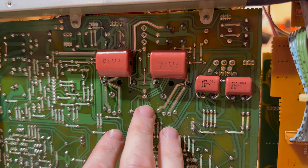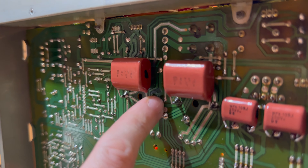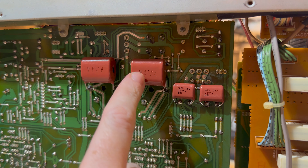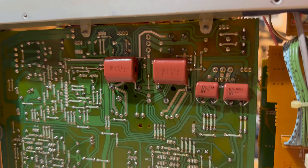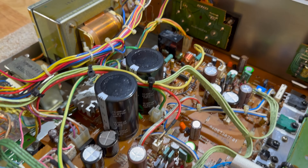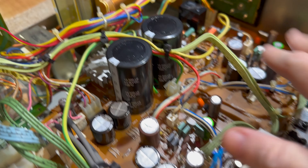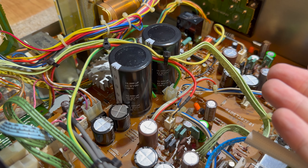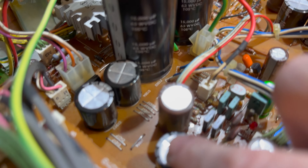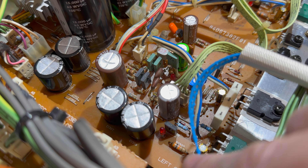There are 4.7uF film bypass caps on the power rails and 1uF on the other rail — I've checked the foil side orientation and they're correctly placed, one for the main supply rail and one for the tube section. Regarding corrosive glue: I spent a lot of time scraping it all off. That era's glue becomes either conductive or corrosive and starts eating through metal contacts. After cleaning and changing components, I also replaced all the metal jumpers since they were going black — more aesthetic than critical, but worth doing.